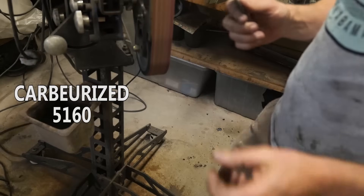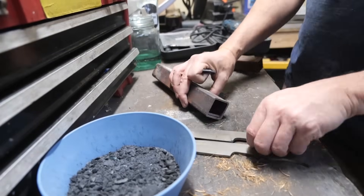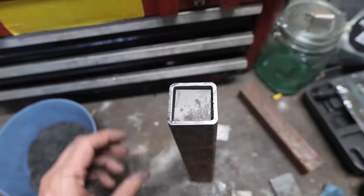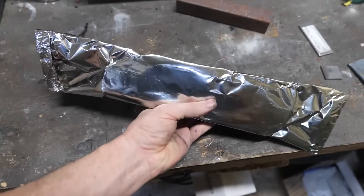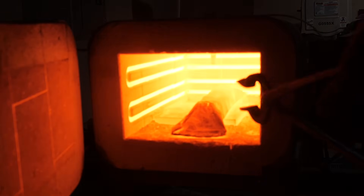It's time to just do it - let's can up our blade and a smaller test piece of 5160, put our carburizing concoction in there, and throw it in the oven for four hours. For added protection I've put some stainless foil around our canister - we don't want a hole burnt in our outer canister and then have our test steel oxidized into bits.